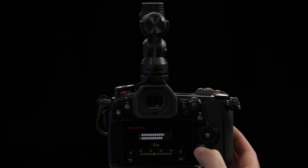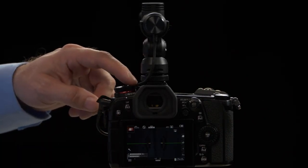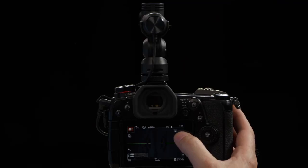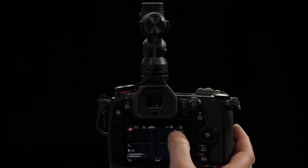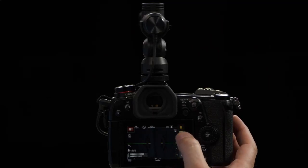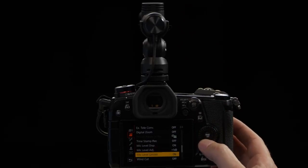There is an easier way to adjust mic level. As long as you have the mode dial in Creative Movie mode — that's the picture of the movie camera with an M next to it — you'll get a tab on the left with a picture of a movie camera. Simply press that tab and you'll have access to level controls, and you can adjust them manually right on the screen. The next option is Mic Level Limiter. Sometimes people talk very loud and then other people talk quiet — a mic level limiter will bring those differences in volume closer together so it's not so dynamic. The benefit is it doesn't blow you out when watching a video; the drawback is during quiet passages you might hear some hiss.